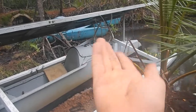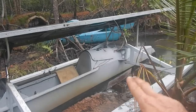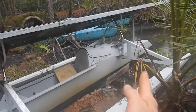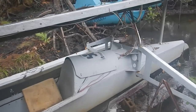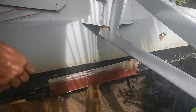I put a sheet of plastic under it, then folded a piece of sheet metal in half and stuck that up there with a brick under it just to hold it in place, so the spray foam should conform to the shape pretty well. After the spray foam is cured, I can sand around the area on this side and the other side, then put a couple sheets of fiberglass in there and just smooth it real nice — make it a permanent thing. With these other stubs, I'm just going to cut them right off and not worry about it. My secondary power source will be this excellent paddle I made like five or six years ago — still in good shape.